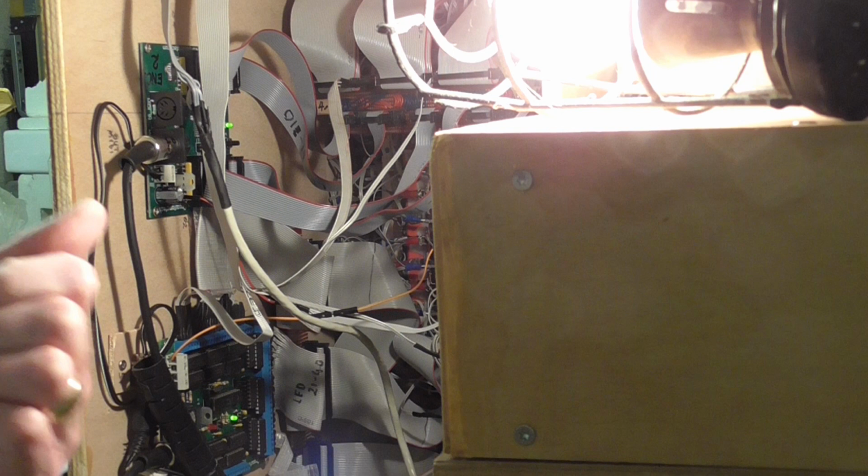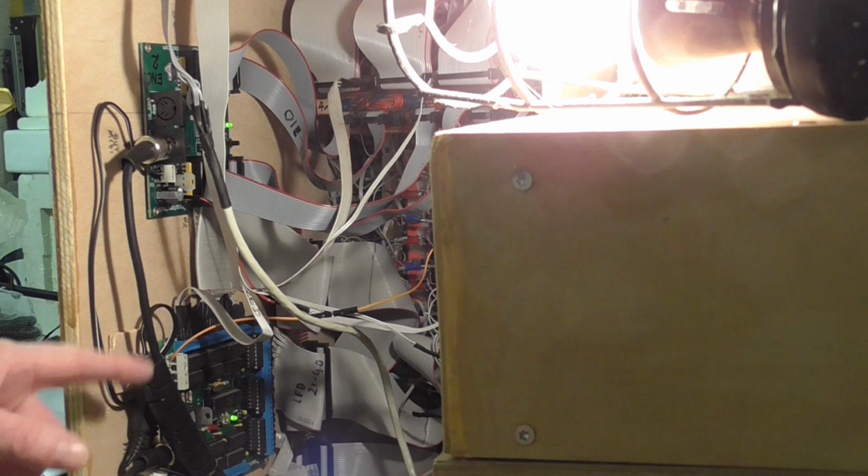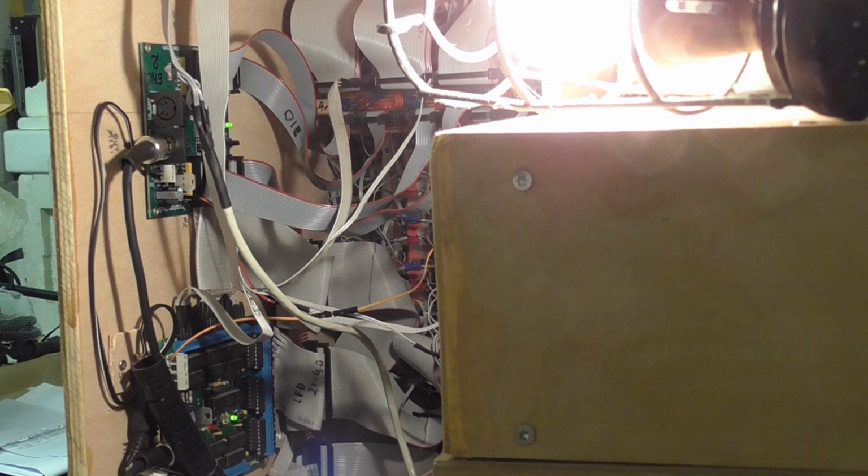So there's your decoder, and that's got 64 outputs, as I mentioned. This has got two different power inputs. They arrive down here, but it's a bit congested, so you probably can't see it very well. But there is a 12-volt input, which is the same 12 volts as drive the actual electronics, and then there's a 5-volt input, which actually drives the LEDs. So having had a look at all that, let's see if we see any more by looking at the left-hand stop jamb, which we will move over to now, because it's possible that some of the things may be a little bit more clearly visible.